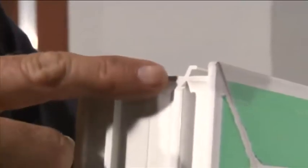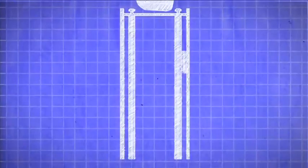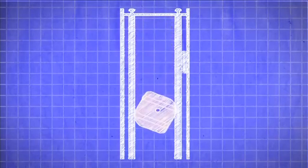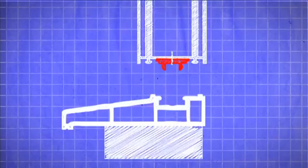You'll notice that each panel corner has the inner legs on the panel detailed, notched away. It's essential that this detail is present to ensure that all 18 mm inline couplings can slide into position. 2 sill support blocks should also be attached to each panel. If they're not, please refer to your instruction manual.